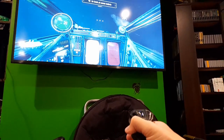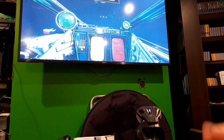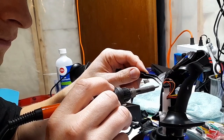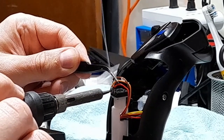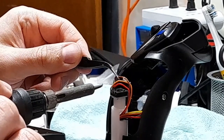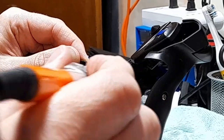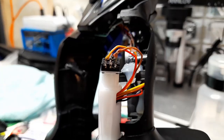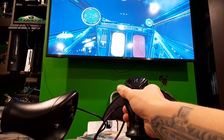So if I turn right I bank left, and if I turn left I bank right — so I'm super close. I think I just have to change the outside wires and it should be good. Just like I had planned earlier, I only used a little bit of solder so I can easily desolder and re-solder these back on in just a few seconds. It doesn't look pretty, it just has to work for the moment. Because they were reversed I just changed the outside ones around — left banks left, right banks right. Nice!